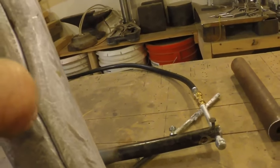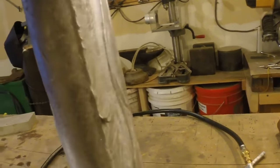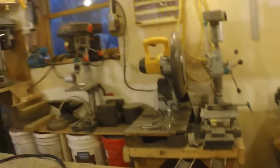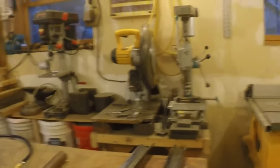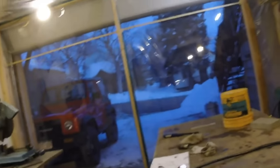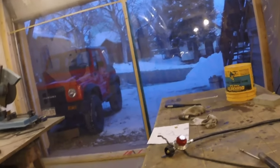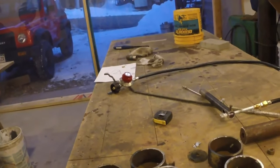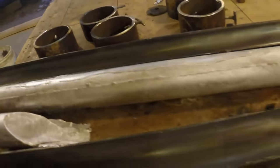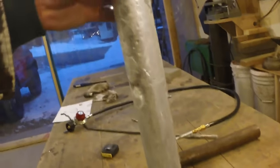So that's what happens when you pour improperly, which I did. I didn't expect it. The metal was going in a direction I didn't expect it to go, so I stopped and then poured it, and that caused that line, and it probably means that this piece is not something that I would want to turn into a drive shaft or anything. However, I'm still incredibly happy because now I can store this. This is so much nicer.